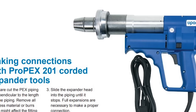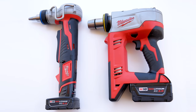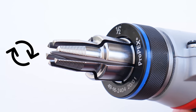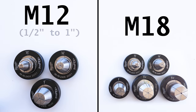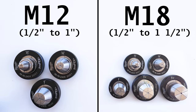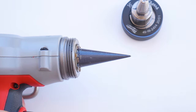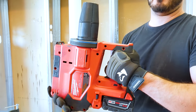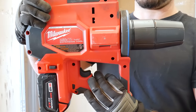Their plans on making an electric or battery operated tool would solve this problem altogether. Fast forward to today, Uponor partnered up with Milwaukee and other companies to bring the battery operated M12 and M18 expanders. The heads auto rotate on both of these models. The M12 expands half inch to one inch and the M18 will do half inch to inch and a half. Going from one size to another is pretty simple — just unscrew the head, make sure it's well greased, and screw the new one in. I know you guys want to see the Force Logic behemoth that does two inch to three inch expansion joints, but I'm keeping the hype for the end.